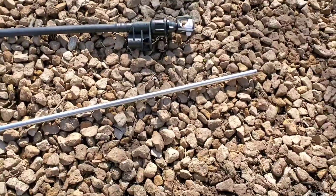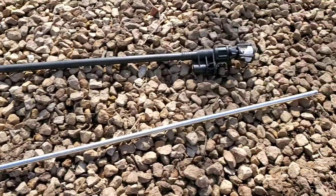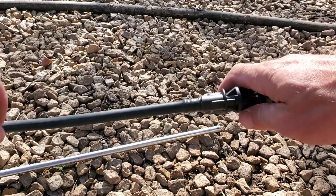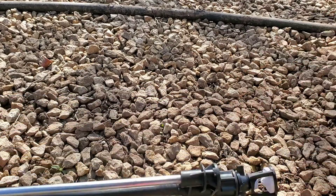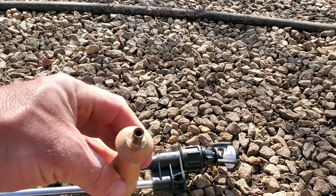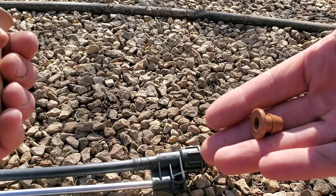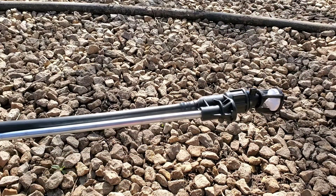You need to choose your stand — I only have one option, it's called the four-foot stand option. That is just a four-foot galvanized rod, I believe it's 10 millimeter. You can pick these up locally, a little cheaper because you don't have to pay for shipping. The other thing you're going to need is a punch tool — it's actually the same diameter as the plug. So we'll just punch this through our main line and insert the plug, then into the plug we'll insert the stand. I'll go over in the field and show you.